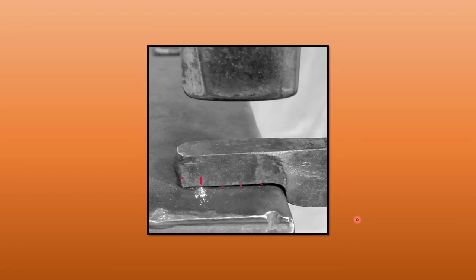Take the stock down until it gets that square cross section. Going from 25%, 50%, 75%, 100% — that's about a 25% increase in length. That happens a lot in forgings, but that's another topic.